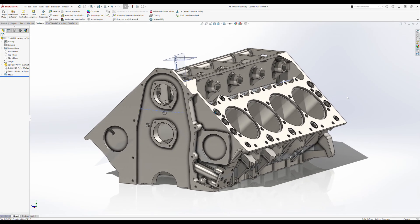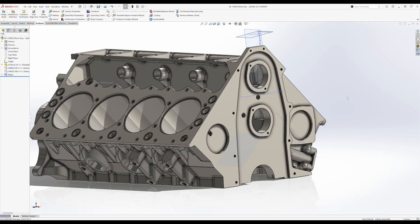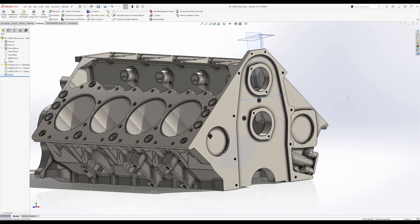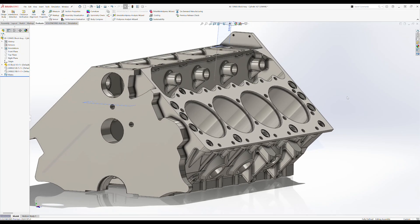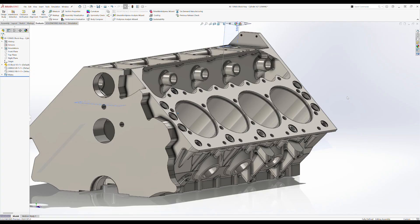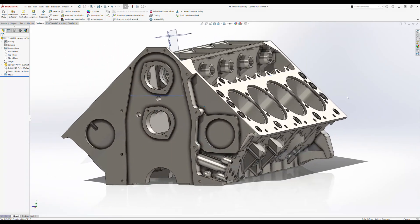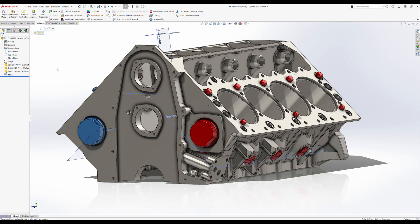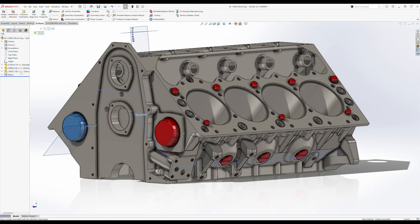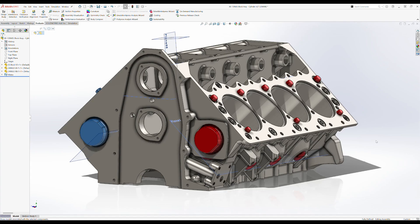Here's a little demonstration of how we get to where we're at. Basically, I designed this thing as a solid — it's not finished yet, I didn't put the water pump holes in yet or anything like that, the bolt holes. But at some point, what we do is we take the scans that Dan had made. And then what I do is I use these to boolean remove all that solid material that's inside the block. So that's how that is done.